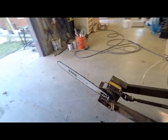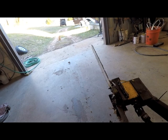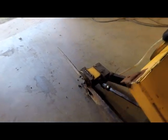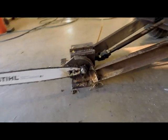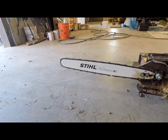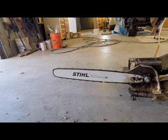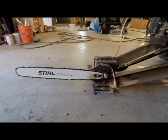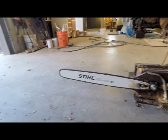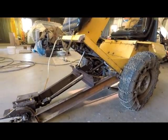That's the deal — hydraulic up and down. I built it so that when you're sawing through the log, you don't want to get into the dirt, so that's as far down as it goes. Once you're through the log, all you've got to do is flip the log over and just finish off that short cut with your handheld chainsaw. So this handles the majority of the heavy work — you're not bending over or killing your back.